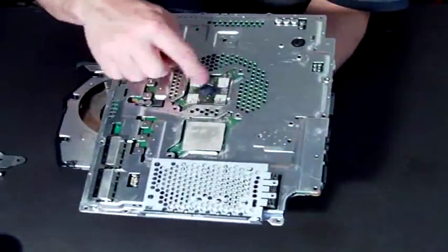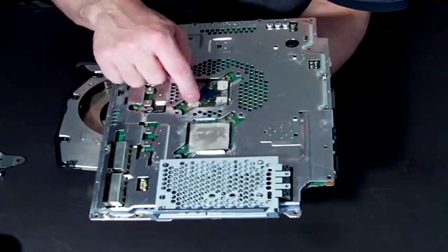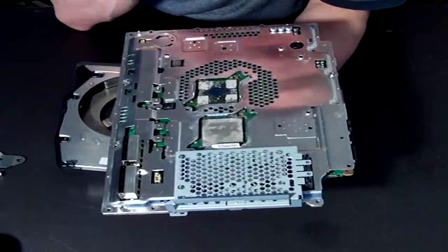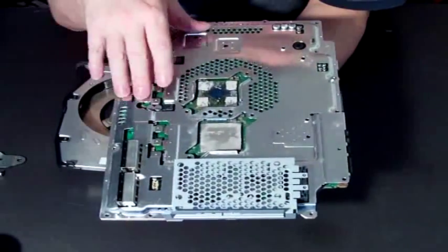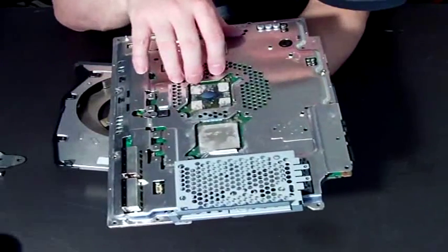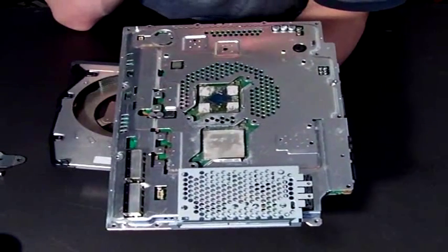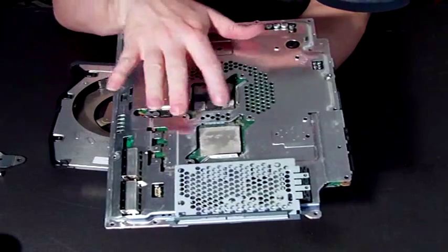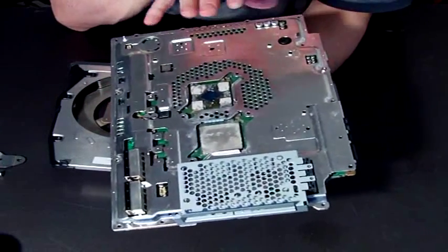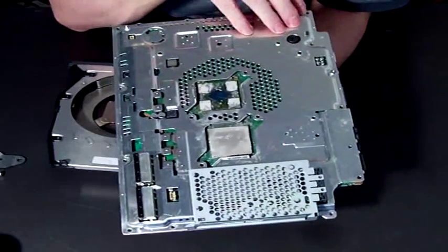Now, this is the top of your chips. This particular chip has the metal plate come off because this board's been overheated by someone. I received this in one of the consoles I bought, and someone's obviously had a very serious go at re-soldering it, re-flowing it, and they've heated it so much that this top plate has come off. So basically I've made no other attempt to repair this — this is just scrap for me.